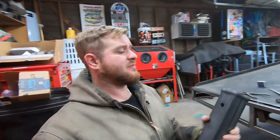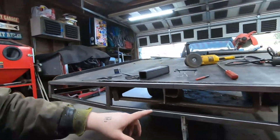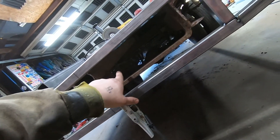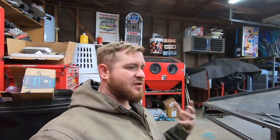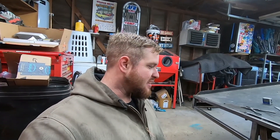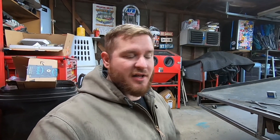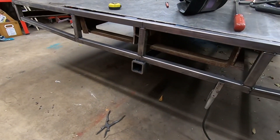Tomorrow I'm going to get out here and start working on tying in the sides and looking at where my reinforcements are going to be for the trailer hitch. This big heavy-duty trailer hitch receiver showed up - I went with a 12-inch because I want to shoot further back and tie in past everything to retain my tow rating if I need to tow a larger trailer. I'll find a good spot to zero it out, make sure it's flat, and get it tacked into place.